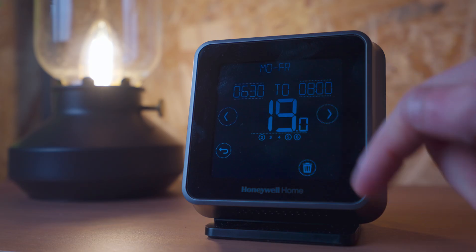Next up, for those coming from a normal thermostat, are the flexible scheduling options. With the T6R you can have Monday to Friday, Saturday, and Sunday as different schedules, every single day differently, or just weekdays or weekends as a schedule. Even further, you get six periods per day — a wake-up time, nap time, going out in the morning, returning in the evening — very different to most thermostats. For example, my schedule has the boiler come on at 7am to 21 degrees, drop to 14 degrees when I leave at 9am, then back to 21 degrees when I return for lunch at 1pm. I use all six periods, which is super handy.